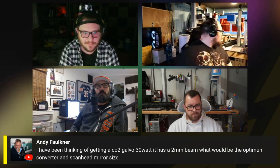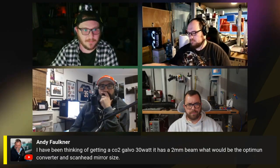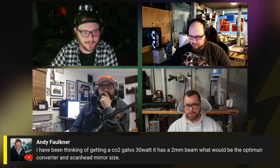The expander upgrade is what matters. So if you take the 8x expander that Kyle is suggesting, you have a 2 millimeter beam and an 8x expander, you're going to have a 16 millimeter beam. That 16 millimeter wide beam is not going to fit on the 10 millimeter mirrors inside the 10 millimeter scan head.